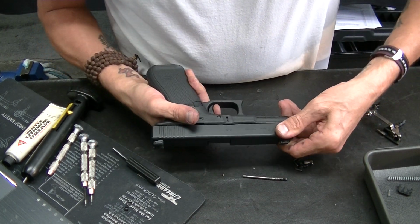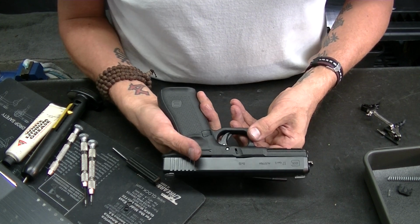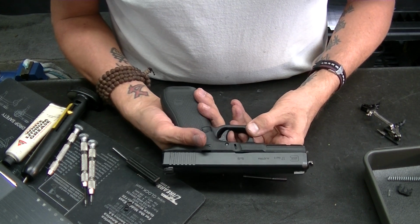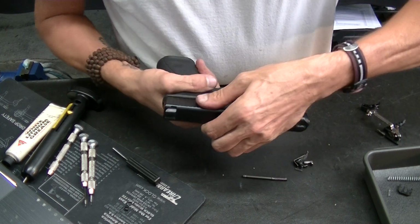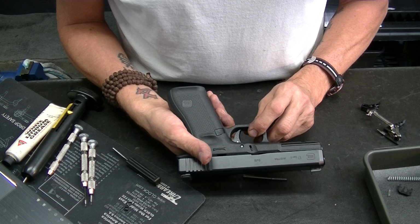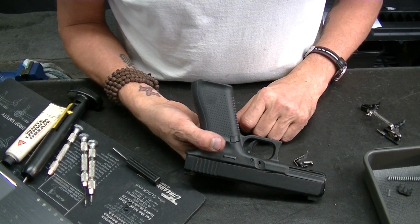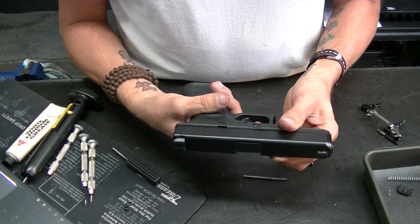and then you release and you don't get a full return. See how that did not come forward? I'll do it again. So break, and now when I let go, it doesn't want to let the trigger safety tab pop out. If you can see back there, now it did, just one click. So that's a big issue.